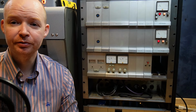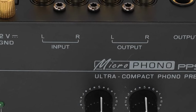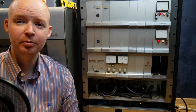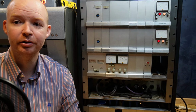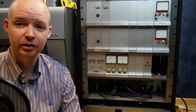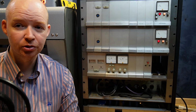You might have heard of this before because pretty much every turntable preamp will have some kind of RIAA circuit that applies the reverse curve for playback. Some people get confused about whether they should master with this in mind or whether you need to do anything in the mastering stage to allow for it. The short answer is you should just ignore these RIAA filter circuits. They're designed to be mostly transparent at both ends, so you shouldn't worry about them.